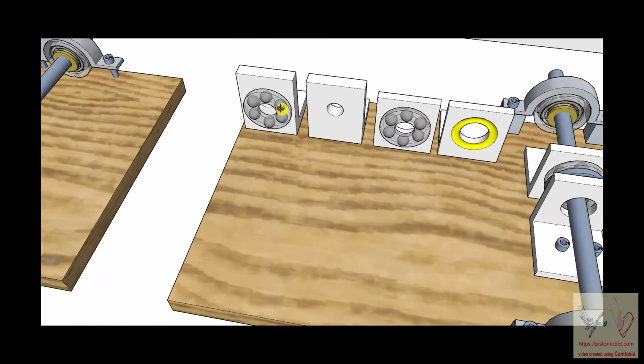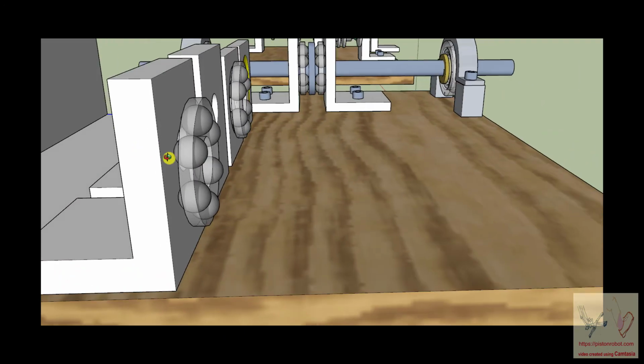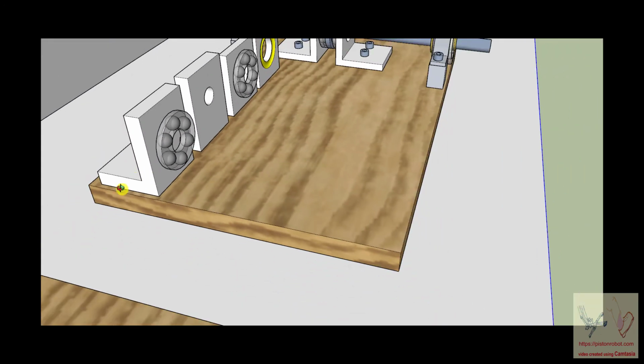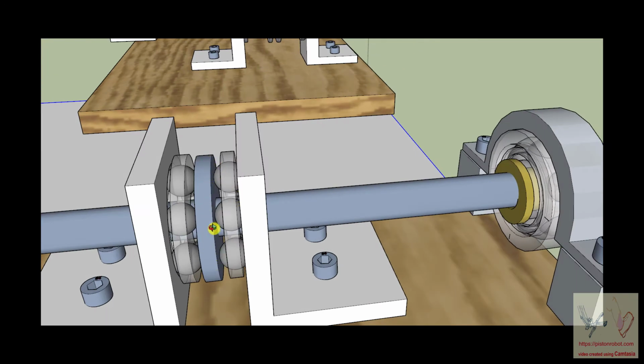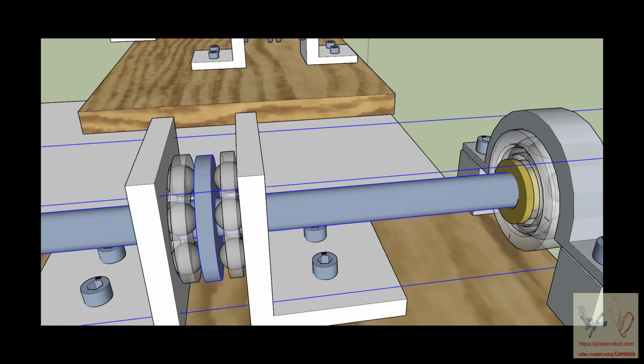And the way that a thrust bearing works is that a ball bearing thrust bearing has little balls that are pressing up against a vertically solid structure. The other thing you have to do is create a flange on the shaft, so that when the shaft tries to move this way or that way, it can't, because it's pushing against these ball bearings, and these ball bearings are pushing against this solid structure.